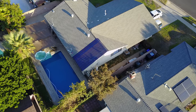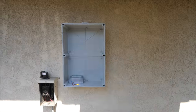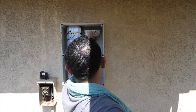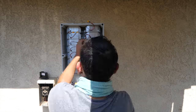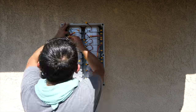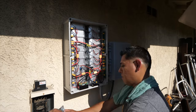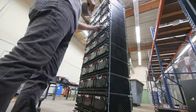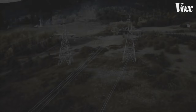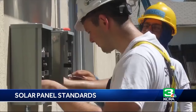My system is just the right size to be affordable, with a short ROI, without sending any energy back into the grid, which would add to the surplus solar energy problem. The second reason to experiment with a grid-tie system is that the ultimate goal is to add energy storage in the form of a battery, allowing me to increase the overall system size by a factor of five and store energy until it's needed well into the night. That will allow the system to not add energy to the grid when it doesn't need it, and not draw energy when the grid is struggling to keep up with demand — that's the ultimate plan to be part of the solution. If every solar system in America had energy storage, the grid could handle ever-growing demand for years to come, while homeowners save money — a perfect win-win scenario.